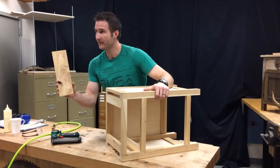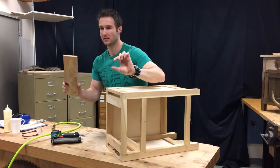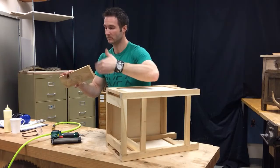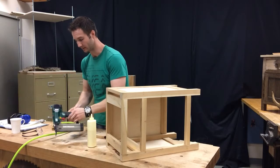The reason we need to have this done first before we can install the drawer guide is because we're going to use the drawer side as a guide for exactly where to position the lower guide. That way we're going to get this drawer guide sitting perfectly parallel to our top. To do that, we're going to use glue and we're going to use a brad nailer.